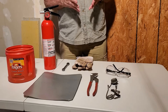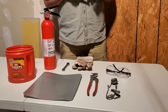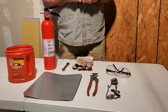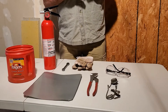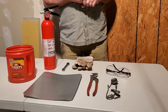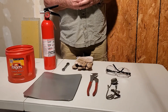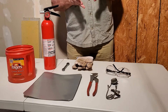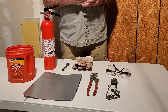We're going to talk about safety right now. One of the things we want to do is protect the homeowner's equipment when we're brazing it in. We're also wanting to protect the homeowner's house — we don't want to put a scorch mark on their house, we don't want to start their mulch on fire around their outdoor unit, and we don't want to start ourselves on fire. So we have to have some safety things in mind as we're brazing copper.